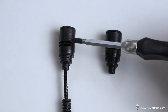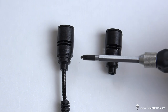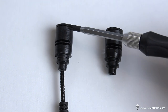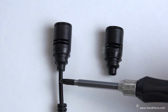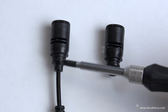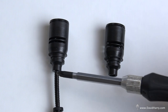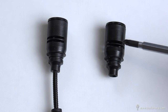So what you do, you get this microphone here, or any number of the other microphones that I'm going to link to, because some of them will be lavaliers, but importantly they will have the same end piece on here. Then at the base of it here, literally snap off with snips the whole bottom piece here, or if this is the lavalier version that you might get, just basically cut the cable out from the bottom, and then you're left with just the top piece like that.